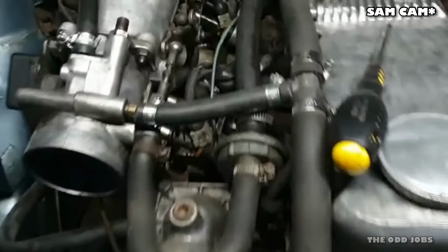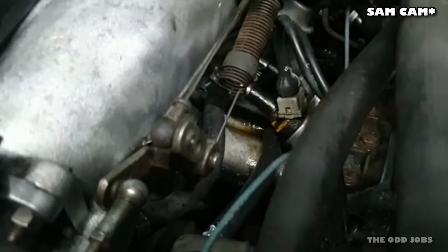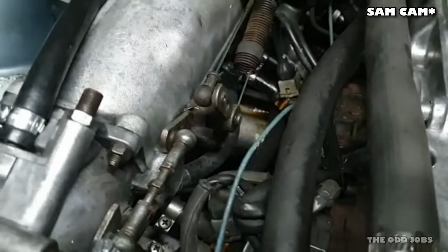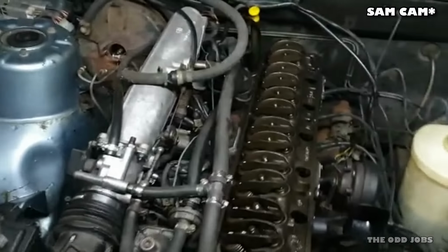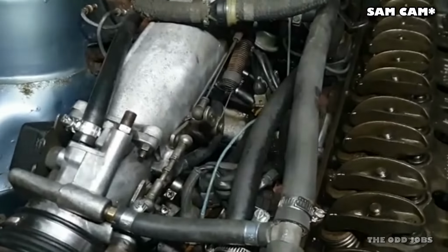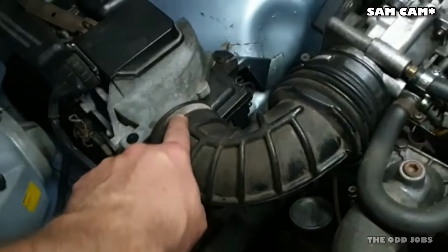And it appears straight away we've got fuel up to the manifold. And I can tell because I've got fuel leaks everywhere, so I'm going to have to nip a few things up, it looks like. So that's good, that's progress. All right, so I've nipped up a couple of fuel leaks. We just needed a tiny little bit of a pinch. I've re-primed the fuel pump using that little trick, and there's no more leaks.